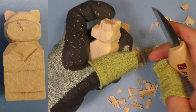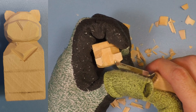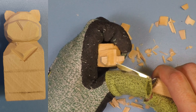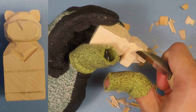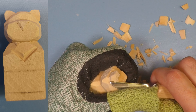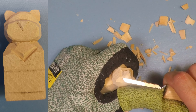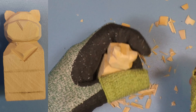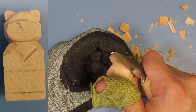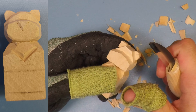I'm going to bring some of the ear around the top forward more, basically creating a little bevel there. Just take off little slivers of wood at a time — doesn't need to be a lot. Since the ears are kind of pointed, I'm going to take in those ears a little bit and start rounding them off. Lop off the corner and then just start doing little rounded cuts there.